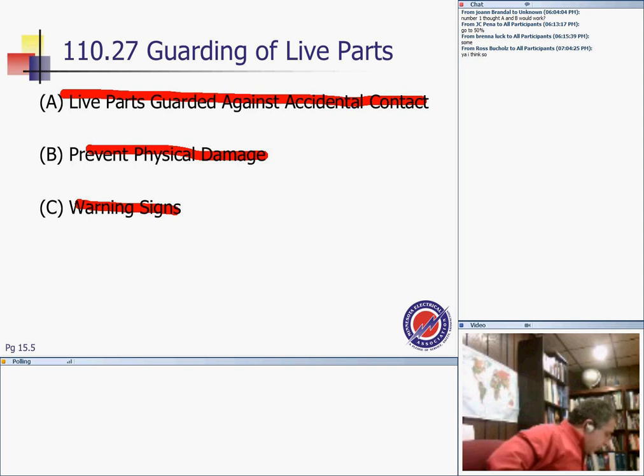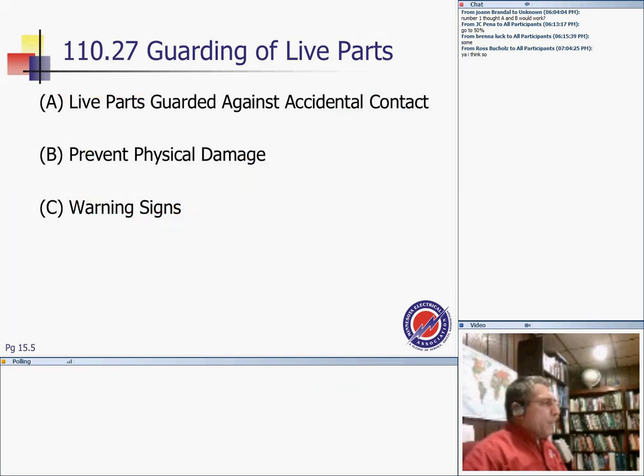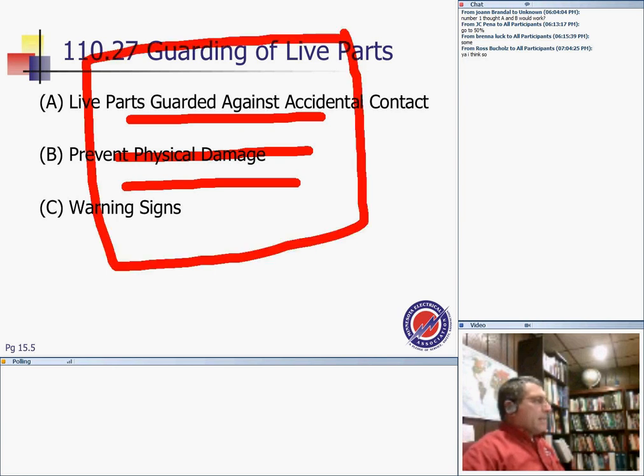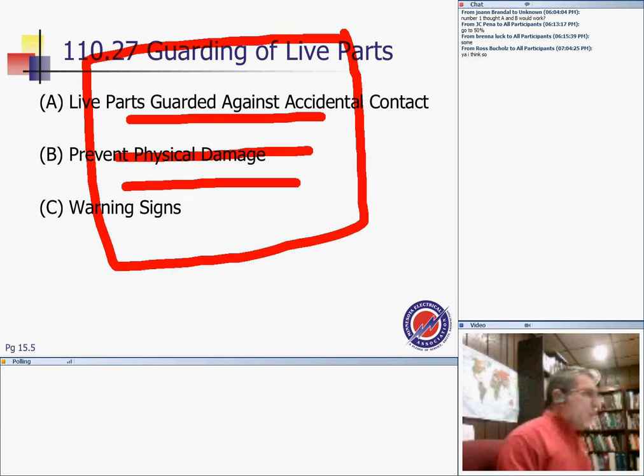people to enter. So what does that mean? If I have an open bus, I don't know if you guys have seen one, these are hot conductors sitting in there. I have to guard them. I have to put them in a locked room with a sign that says, hey, if you enter this room, there are exposed hot conductors and bars.